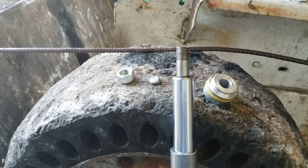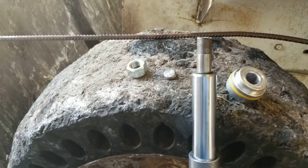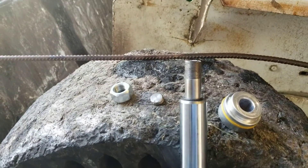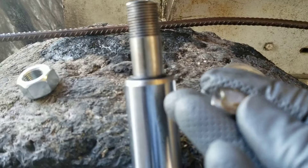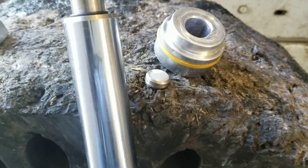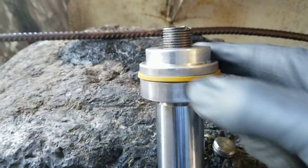So we had a little hiccup. When this nut came loose and was bouncing around inside the cylinder, it knocked out all the threads on the end of this piston rod. So we just had to cut it off about a quarter inch — it's still hot — and there's still enough to put the nut back on. Now I can thread that nut back on.